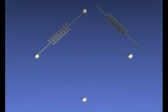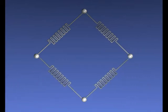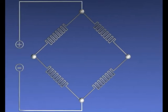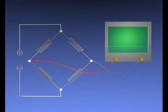In a Wheatstone bridge, four resistors are connected to each other. Two diagonals result. Voltage is applied along the first diagonal, and the resulting voltage is measured over the second diagonal. Heating one resistor unbalances the bridge, and the displacement of voltage over the measurement diagonal can be recorded. By heating two opposed resistors, the bridge becomes even more unbalanced. A circuit of this kind is a bolometer, suited for radiation measurement.